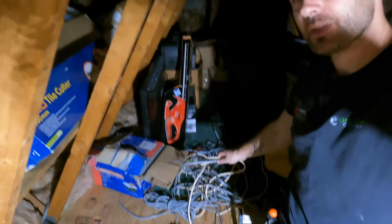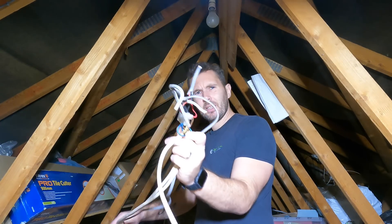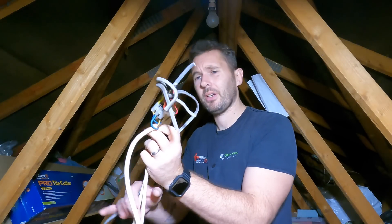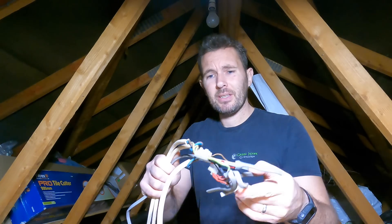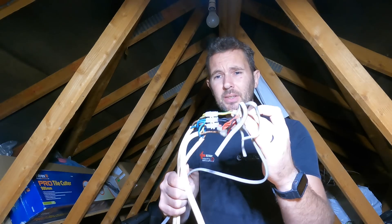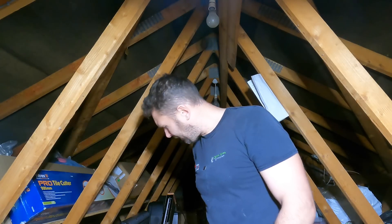As I'm standing here, I've got a big pile of cable behind me. One of the things - the classic bathroom fitter situation. I'll try and find some photos on my phone from when I came up to do an inspection on this house. That is basically how it's been left. Singly insulated cables, not in an enclosure, no sleeving on any of the CPCs, really weird use of flex and all sorts. Again, bathroom fitter sort of job.